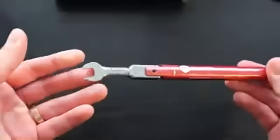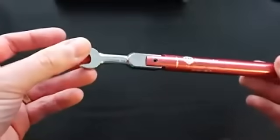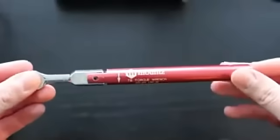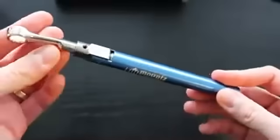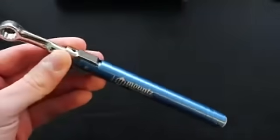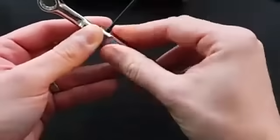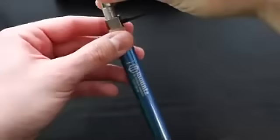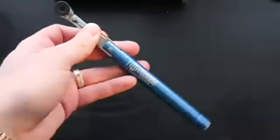So those wrenches, again, as we've seen during the presentation, can come with different types of heads. Here we have a 9mm open end, and it's fixed to the tool, so it comes as one with the tool. There are also other types of breakover wrenches available. And here you will see the difference is a screw. What that means is that we can loosen that screw, remove the box head, insert a new head, and we have a new tool.